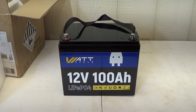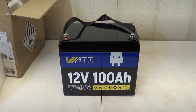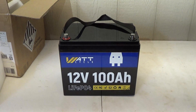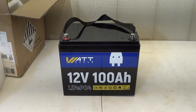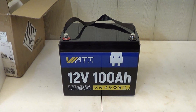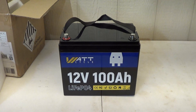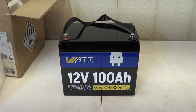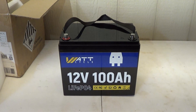For a small battery like this, you might wonder how long you can run a device. With a 50 watt load you could run it for about 23.5 hours. With a 100 watt load like a TV, almost 13 hours. Pulling 500 watts like a refrigerator, about two and a half hours. At 800 watts like a small microwave, about an hour and a half. At 1,000 watts — a coffee maker or heater — this battery would run that load for about 1.2 hours.